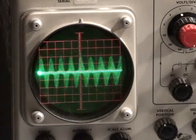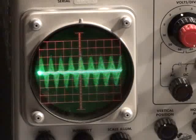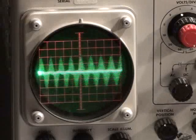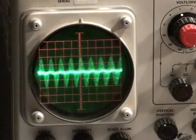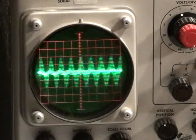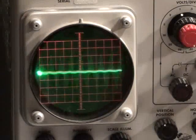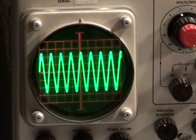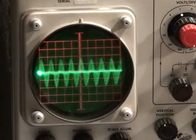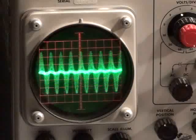I'm going to press the volume on/off button. Now, you can hear that little chatter there — since the remote chassis is on its side, gravity is not working with that relay because it's got a big aluminum relay piece that goes over the top to actuate the volume stepper. I'm just going to put a little pen in between there and it'll stop that. So, as that tuning fork dampens down, you lose your amplitude of course. We're going to adjust that detector coil and peak it out.